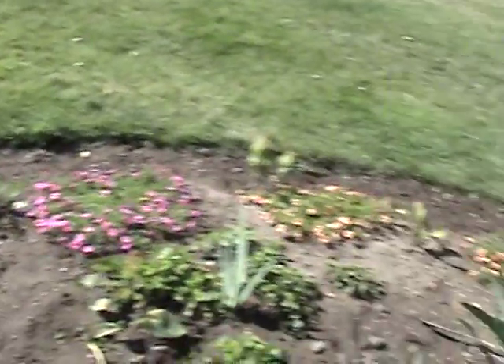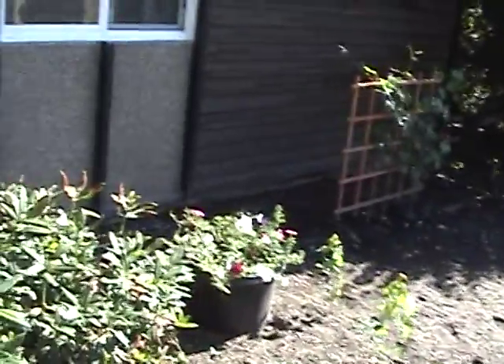Now I haven't cleaned this house up because I need to show what I'm doing — I'm kind of keeping a record of it. The number one thing about doing a house is the surface must be prepared correctly. There used to be a gigantic bush right here, 35 years old, and I couldn't get in and paint this when I first painted this house. So if you have any bare wood spots on anything, you want to use oil primer. This is rule number one.